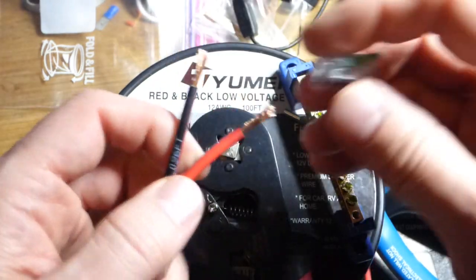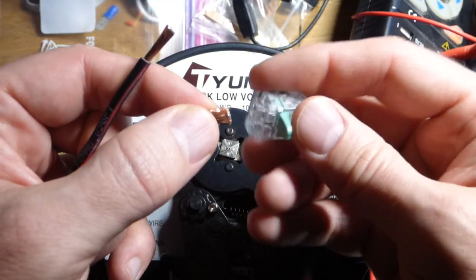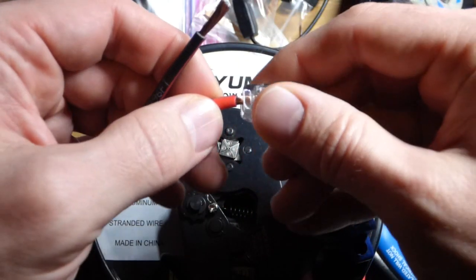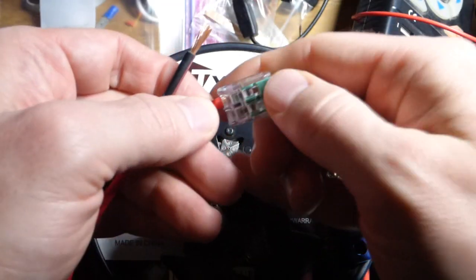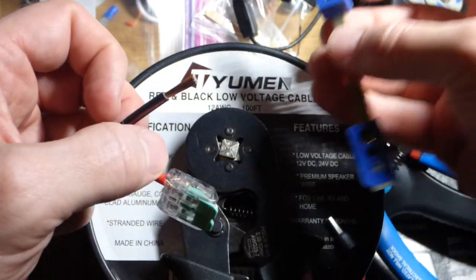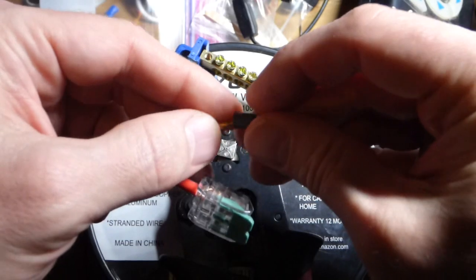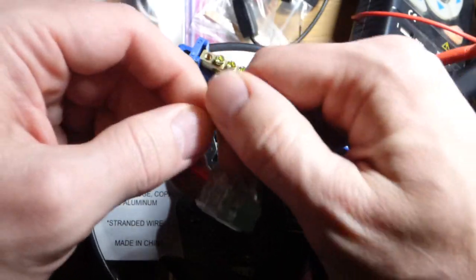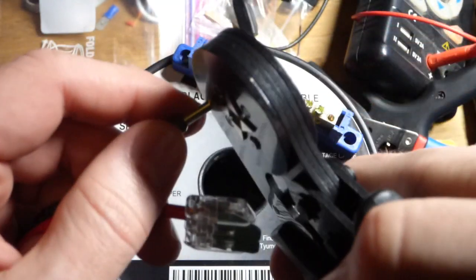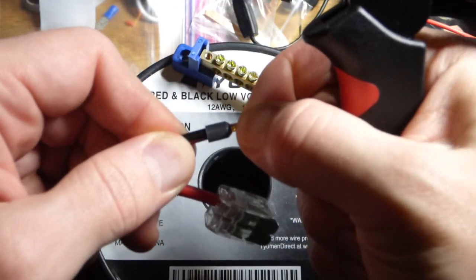Now we're going to put connectors on one side of the wire — this side is still attached to the roll, which helps hold the strands in place. I set it into the open connector. Again, this is 12 gauge wire and the connector's maximum is 12 gauge, so it's a bit difficult to get in, but now I've got it clamped down and that's a good connection. For the other side, we've got the ferrule — this ferrule is for 12 gauge according to the kit, and the crimping tool came with the same kit. Get the strands in there; it helps to spin the ferrule as you slide it on. Push it until the insulation stops it, then use the little ratcheting tool. Slide it on and now we've got a ferrule on there. Tug on it — it should not come off.